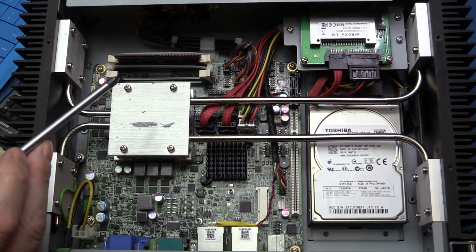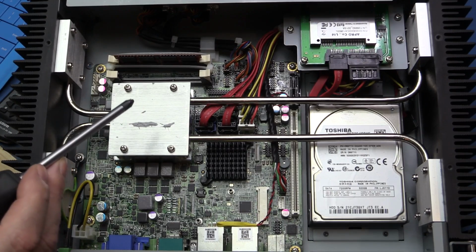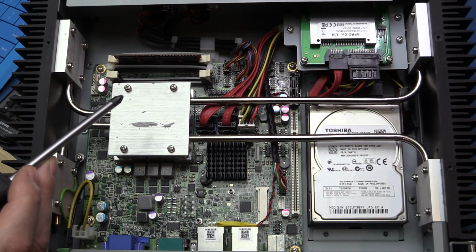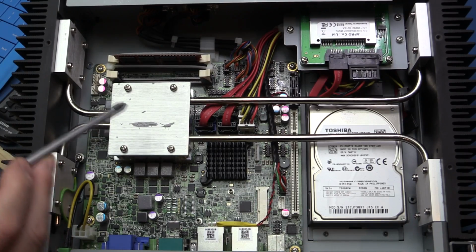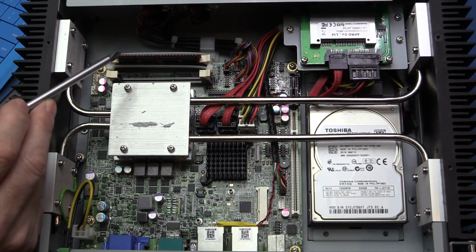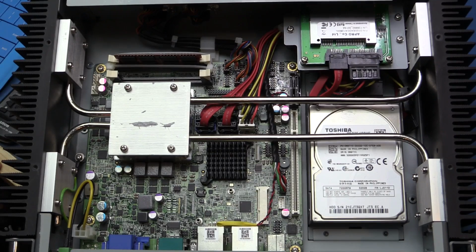Now, obviously, if you're at the high end of the temperature range, then you could be powering this up with an ambient temperature of 80 degrees centigrade, and you still want this to be able to work. So if you do add your own parts, make sure you put in parts that are capable of handling the temperature range. The whole thing works from a 9 volts to 24 volts DC input range.